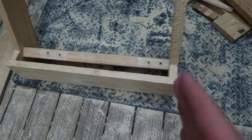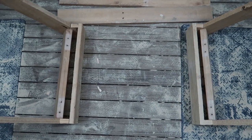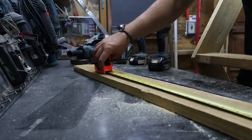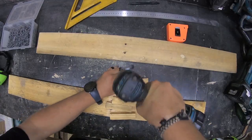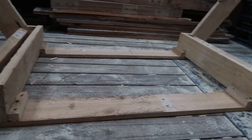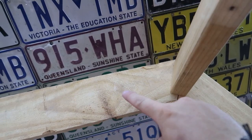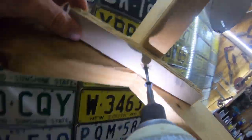Back on track after a couple of little bumps in the road. At the bottoms I've cut them flush - I didn't really like the look of them sticking past. There's not a whole lot of support at the bottom and they're wanting to come towards each other. So I've got these two pieces cut at 950mm, and I'm going to screw some little uprights to them - they're basically going to click in and stop the two ends from coming towards each other. The main reason for not having a bar across the bottom is to avoid a tripping hazard. I'll also cut some pieces underneath for a little extra support to keep the gaps from opening up.